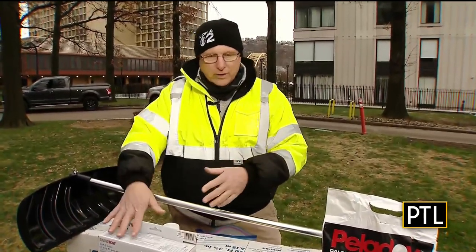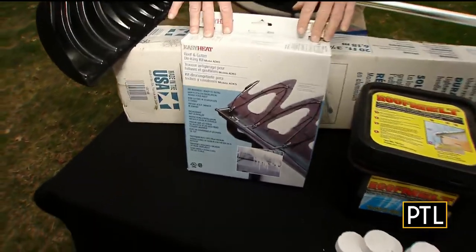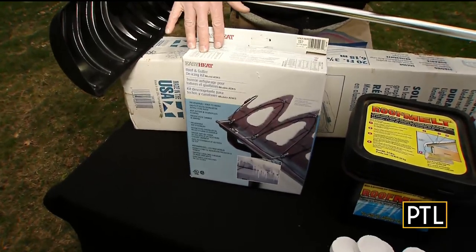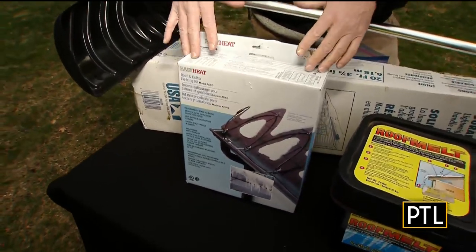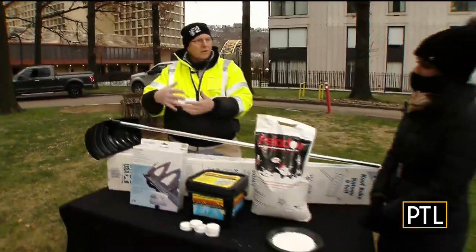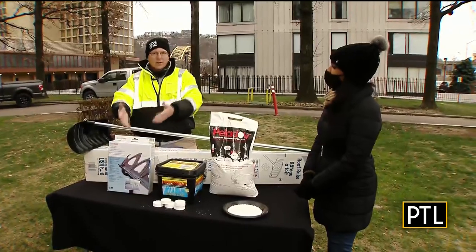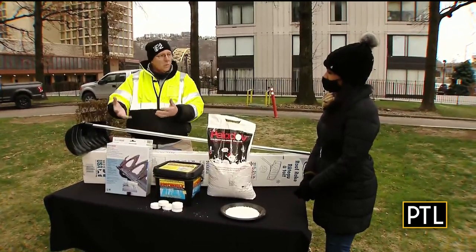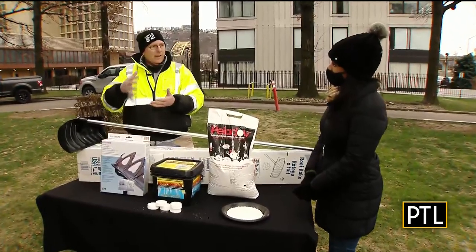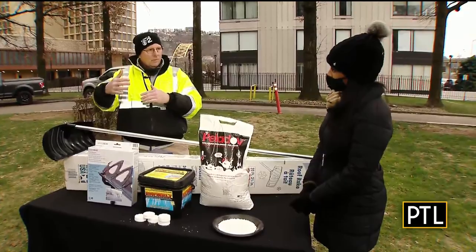Either clean the gutters, or there are heat cables that you can put on the house — but you don't want to be doing that in the wintertime. This is something you could do in July and August to help prevent it. These heat cables for the gutters are marvelous because they work on a thermostat: if it gets cold, around 30 degrees, they turn themselves on, and when it warms up again, they turn themselves off. They prevent ice and snow from building up inside the gutter and up the roof itself.